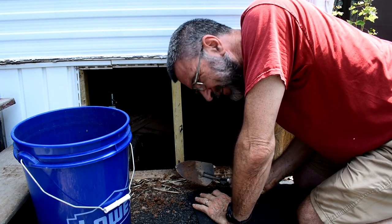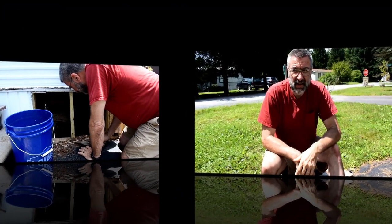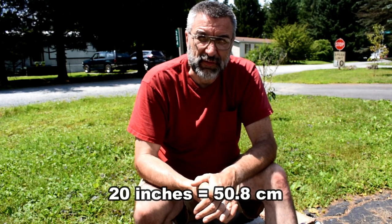That's as far as I can reach. I'm down about as far as I can go — reaching through there and then down into the bottom. I'm about 20 inches. I really wanted to go further but I just can't reach anymore. The old pier was about 8 inches; I'm now down 20, so I've gone an additional foot. I hope that's going to be enough. So let me show you what I'm going to do here with the pier to build it.